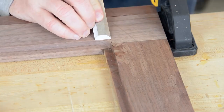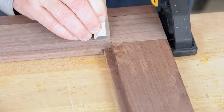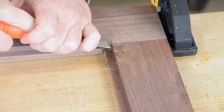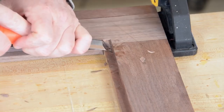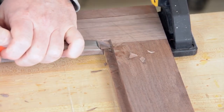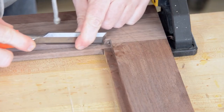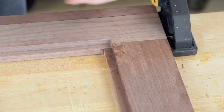The rabbet corners have to be cleaned out by hand. After using a knife and a steel rule to mark where I want it square, I set everything nice and deep with the chisel and then go to work clearing out the material. It's important to cut cross grain — use the hammer, use the chisel, make sure you have severed the fibers cross grain. You can then pare it long grain without fear that it's going to tear out and make your corner bigger than you intended. With the bulk of the material gone, you can pare out whatever's left. This is a great time to make sure your chisel is razor sharp because that corner is really hard to sand.